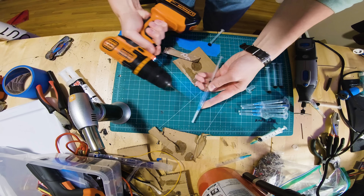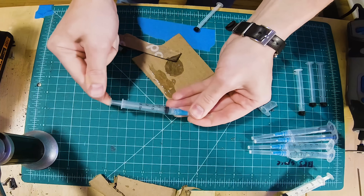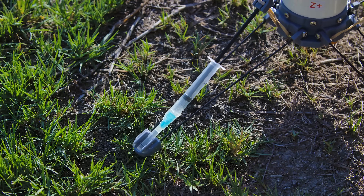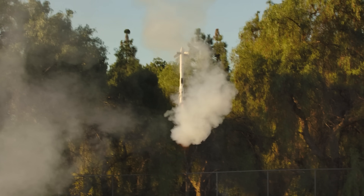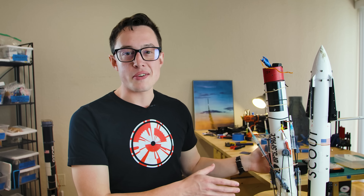Most of the syringe vents through a small hole to limit flow rate, and then around one centimeter from the bottom, we pass the relief hole, and past that point, the air inside the syringe is compressed. This helps us dissipate just a little bit of energy on impact, although it is certainly not the most sleek-looking solution. And while this might have worked, we'll never actually know because the legs did not deploy on this flight — we were coming down too fast — and I am changing the design again so that we probably won't fly with the syringe legs.